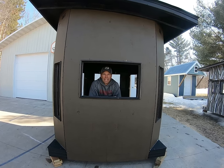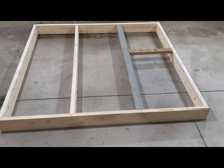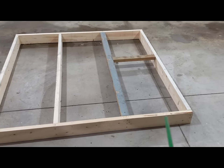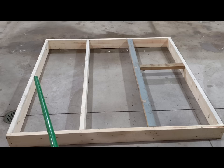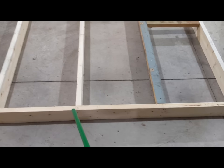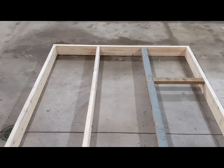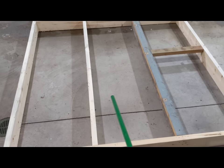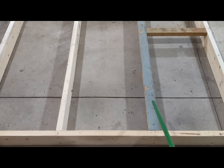For the base, you're going to need two-by-six lumber. For the ends you'll need two pieces exactly six feet long — 72 inches — and then four pieces that are 69 inches. They'll fit in between, and they are two feet on center, so we're flush on the outside. This one's two feet on center, this one's four feet on center, and that one's on the end as well.